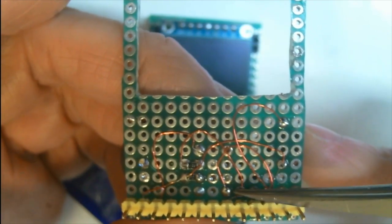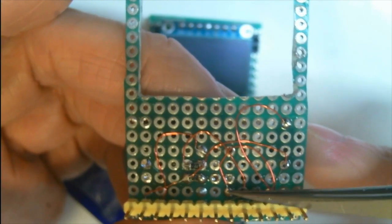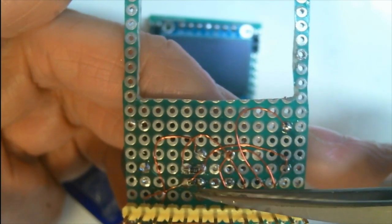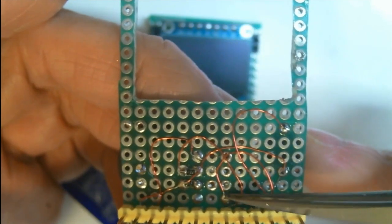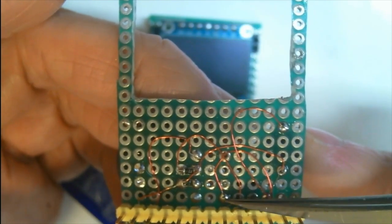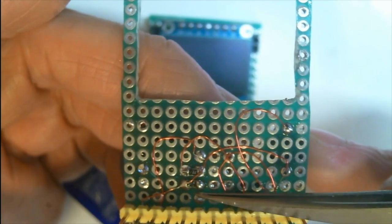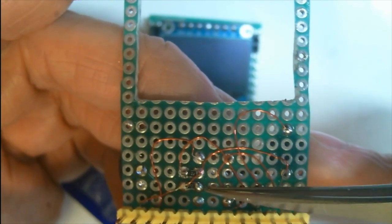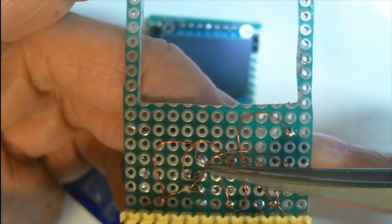For example, if you use A3, which is for the up button, if you turn all the way down to create a 0 ohm resistance, it is in effect the same as pressing the up button. So we don't want that, because if you have the up button pressed, something may happen. Some of the hot buttons may trigger something else.